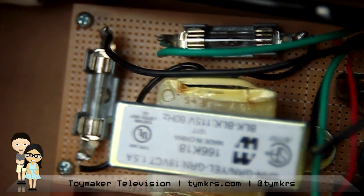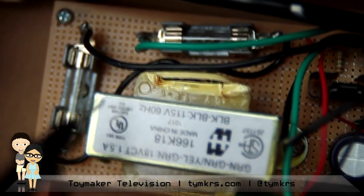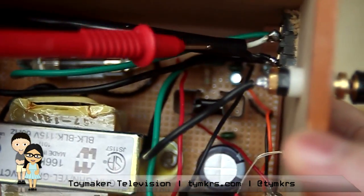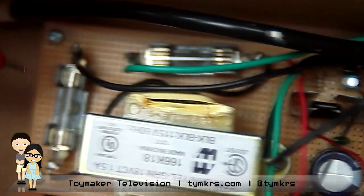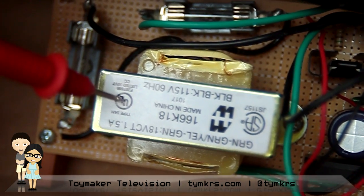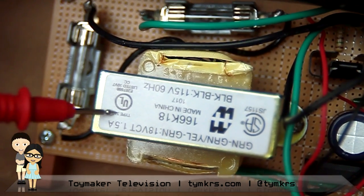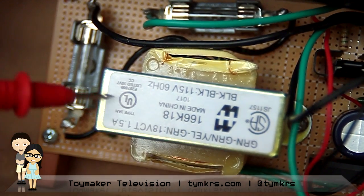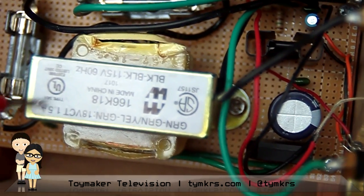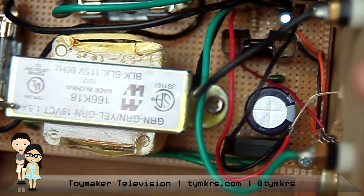Well, kind of. So I think of the equations that help calculate what's actually necessary in 4 different stages. So we have the wall power, which is the 115 AC, and then we have the transformer, which is 18 volts AC at 1.5 amps. That's what it's rated for. And note, this doesn't mean that more current won't go through this. It just means that past 1.5 amps, it'll blow up, kind of. So it's rated for that, but it doesn't limit what goes through it. Yeah, don't pull 1.5 amps through that thing. It would be bad. Right.